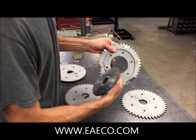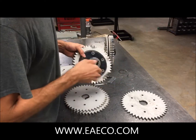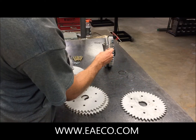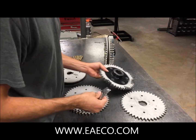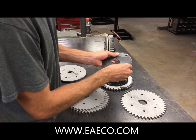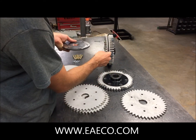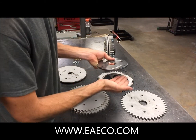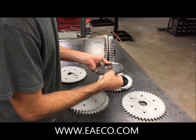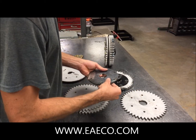So you just have to make sure you put the recessed side like this relative to the hub. These shims come with every drive wheel assembly and they go on either side of this spacer disc that's inside of here. It doesn't matter what side you put these on, just as long as you keep all three shims on one side or the other. You have to do all three on the same side — either way it doesn't matter, just make sure they're all on the same side.